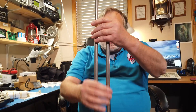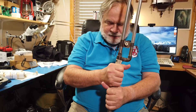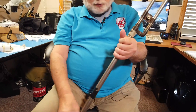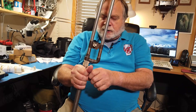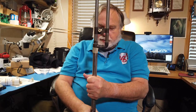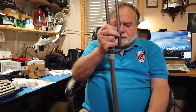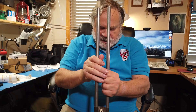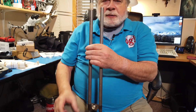This is not just a feeding or matching stub — it is a quarter-wavelength stub, and this is the correct place to feed it. The section below is peripheral; it's just here for mounting. So this would be mounted to your flagpole. Your coax would come up here and be waterproofed. The flag would hang out here, and the antenna would be bound to the flagpole with duct tape — or whatever you like. You can even get white duct tape to match your white antenna pole.